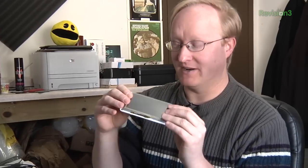Let's use a BeagleBone cape. A cape is a device that you plug into a BeagleBone or BeagleBone Black. This is the LCD cape — you can actually run Linux right on this cape. BeagleBone capes have an EEPROM on them that tells the BeagleBone what the cape is. The EEPROM has data on it including the name of the cape, what pins it uses, and information like that, so the BeagleBone knows what to do with it. Since it isn't keyed, you obviously want to plug it in the right way.